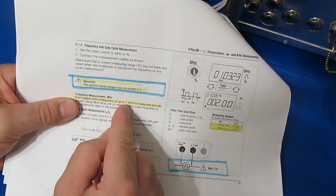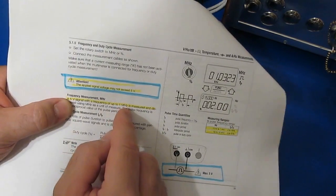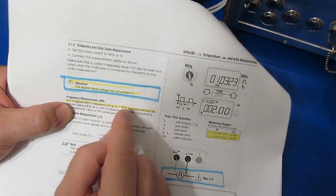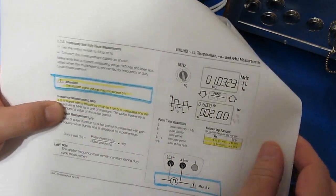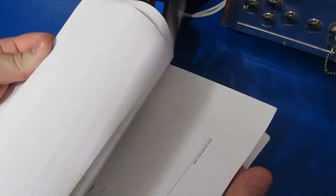You can see it has a maximum frequency of 1 megahertz, and we had measured that - it does go just slightly above this. I believe that's limited by the firmware in the meter, not actually a hardware limit, but that greatly limits what you're going to be able to use this meter for. My concern is really what the threshold levels are, because when I first looked at the meter it looked like it was very sensitive to what those levels were.